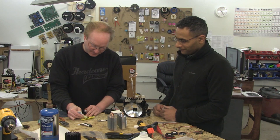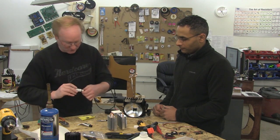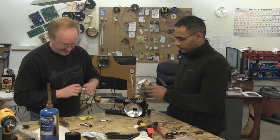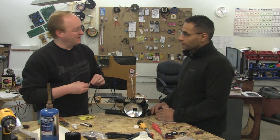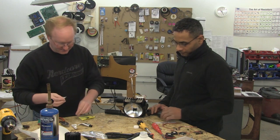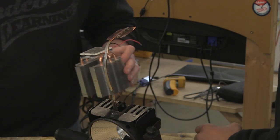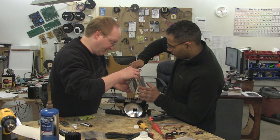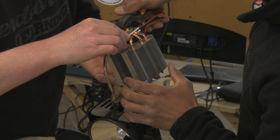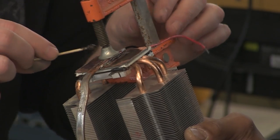Here's my plan: we're going to use Arctic Silver to connect the copper plate to the Peltier because that's what it's meant for, and then we'll use a little bit of JB Weld just to hold the plate in place — the actual heat transfer will go through the Arctic Silver. Felix is going to help me. Let's have some clamps on the ready. We'll smear the Arctic Silver on this, clamp it up, and then apply the JB Weld to the corners. I'm using up all my Arctic Silver for this project. JB Weld coming in hot.